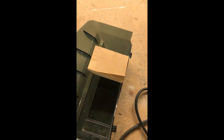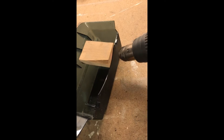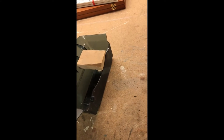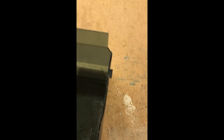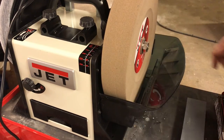Another little detail is on the water container, where you have a hook that has to grip a hole behind the grinder wheel. It's bending a little and it's hard to catch the hole behind the grinder wheel. To straighten it, I put in some scrap wood and then used a heater to heat up the plastic so it would take a new form. After mounting it, it seemed to be better — perfect.